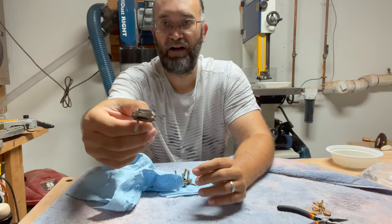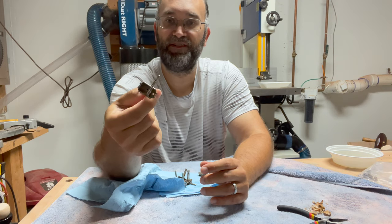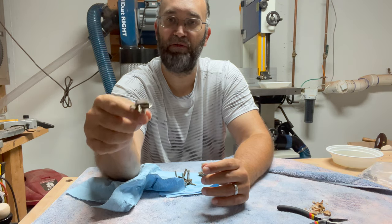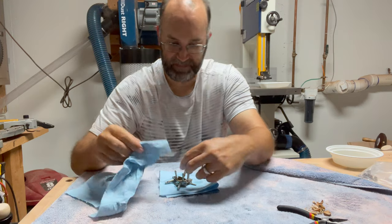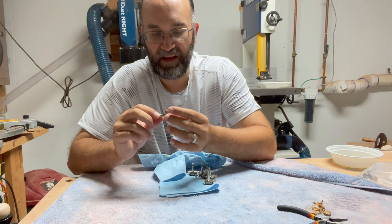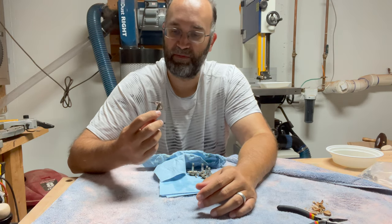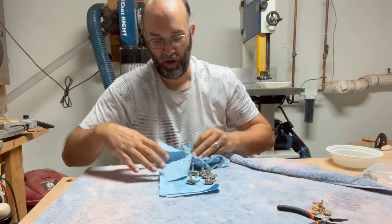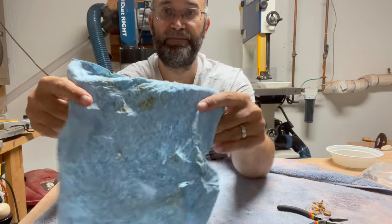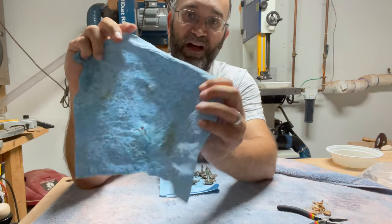This one's not bad, it's a little rougher. Maybe this one would do good to have a naphtha bath. And this one's still maybe a little bit crustier than I would like, so about three of them probably could use something a little stronger. But on the whole, you can see that the WD-40 is helping take off a lot of this surface rust.